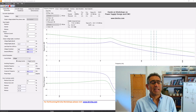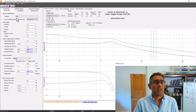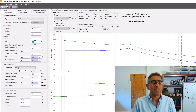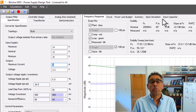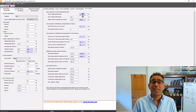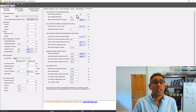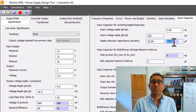We are now going to show exactly how we select our capacitors down to the component part number. Here I'm running WDS — it will calculate everything we talked about on the board. Let us design a buck converter with 12 volts in, 3.3 volts out, and 2 amps. We go to the input capacitor section and first select our ceramics — we've covered that in a different video. I'll set the ripple to 0.85%, which gives around 100 millivolts. WDS calculates about 22 microfarads, but as discussed in the previous video, we need to increase that due to DC bias loss, so let us put in 33 microfarads.